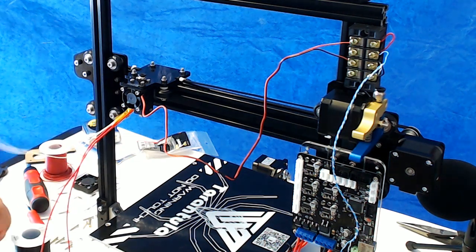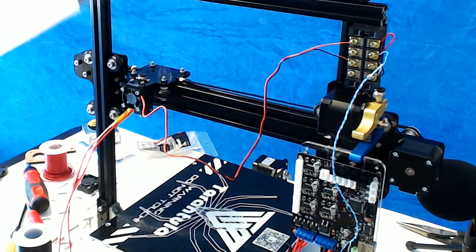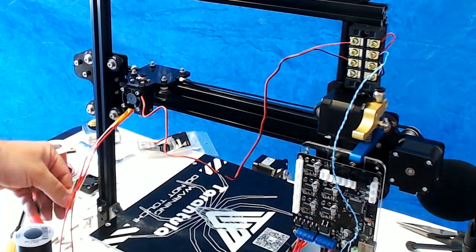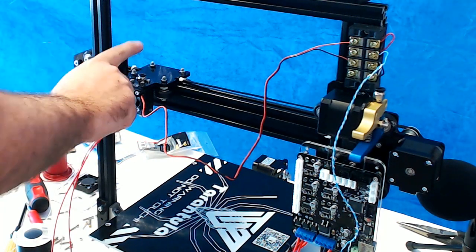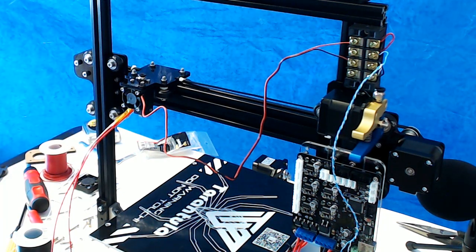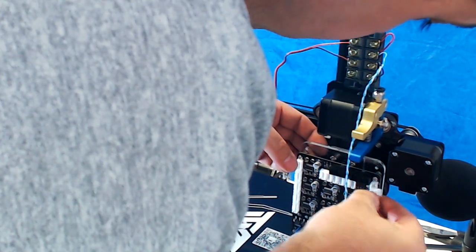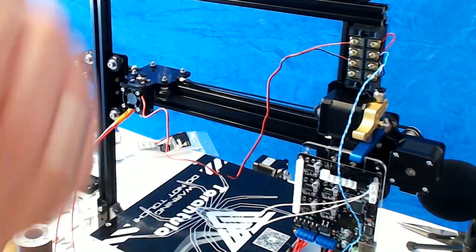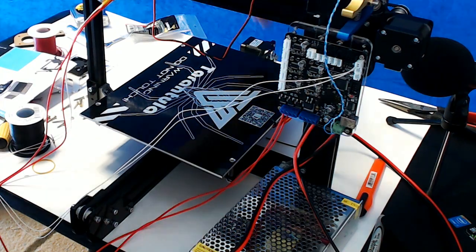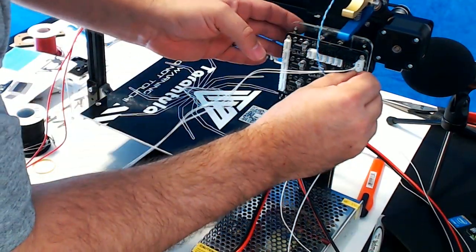That's already mounted so we can go ahead and bring these on now. This is the thermistor plug — if you look at the instructions there's a wiring diagram right here, and it'll tell us where the rest of this stuff goes. The thermistor wire, the white ones from our extruder and hot end, go to nozzle thermistor — that's the top plug. Our heat bed thermistor is the next one down, the same type of wire coming out of our hotbed goes into the next one down.